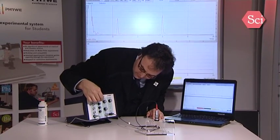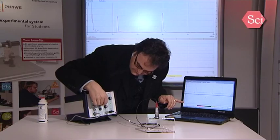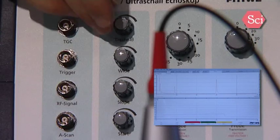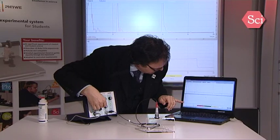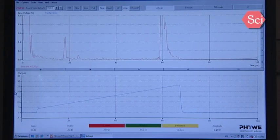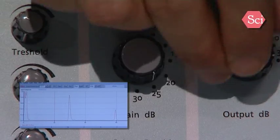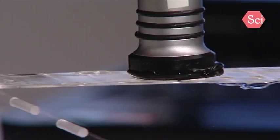So for this, you have the first knob, which is the start point. So you can here now see the control. I have the start point. I will now adjust some slope and also a threshold. Threshold increase, adjust the slope, and the starting position. The goal of this setting is that equal flank dimensions at different depths are shown with equal heights of peaks. So for this now, we have to adjust the parameters so that the different peaks are shown with the same height.